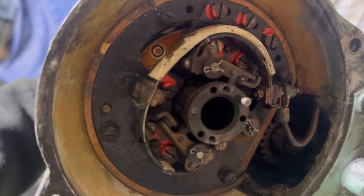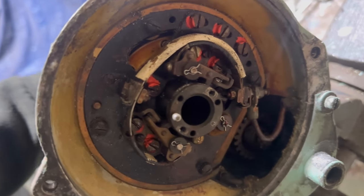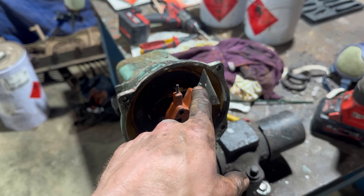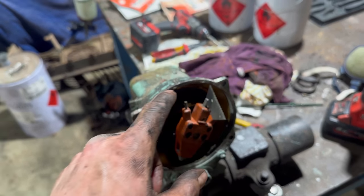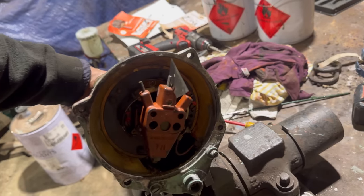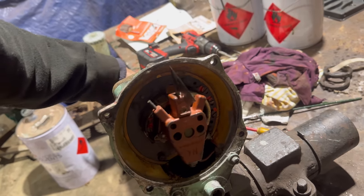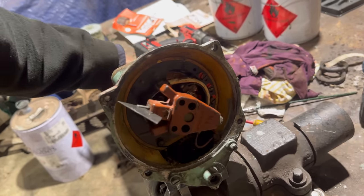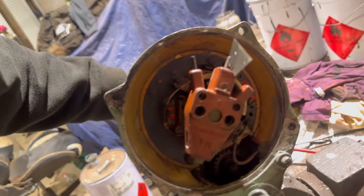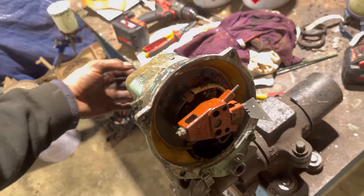There you go, by hand, she's sparking. Now what we're going to do is test that the spark is coming to the end of the rotor arm. So I've trapped the blade in it. With any luck, when I spin it round, there you go, you should see every point, every place it sparks, there's a spark plug. Now let's see it without the lights on.